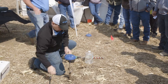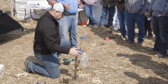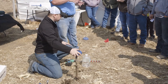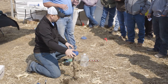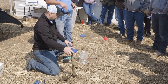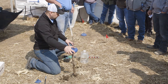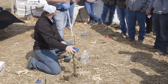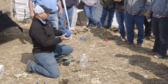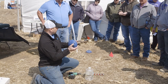One thing that's unique about our sensors is they're non-slurry. You don't have to auger a hole, then take part of the dirt that you took out, mix it with water, get a mud-based milkshake, and pour it back in. There's none of that. Our design is a simple drill bit in the ground. You drill it out, and the way our sensor's designed with the 3D technology, it slices into the side of the hole where there's no slurry, making installation a lot easier. We actually have a sensor on top of the auger, on the bottom of the auger, and on the side.